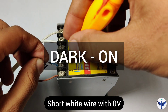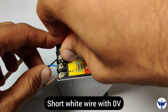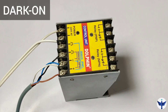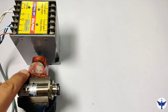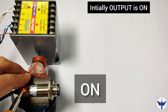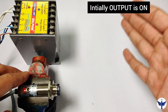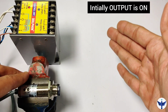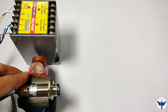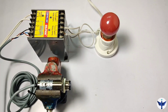Now coming to the dark on mode. For that I will short the white wire with the ground or negative terminal of the supply voltage. Now the device will work in dark on mode. Dark on mode can simply be understood as: when there is no target, the sensor is already giving the output. We can see that even with the target absent, the sensor is already giving output. So the initial state of the sensor is NC — normally closed. When the target obstructs, the sensor output gets turned off. This is called dark on mode, or simply a NC type output.